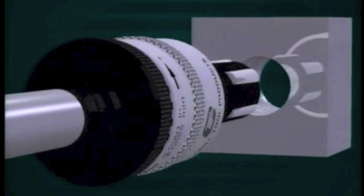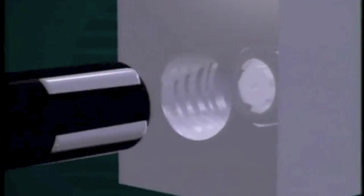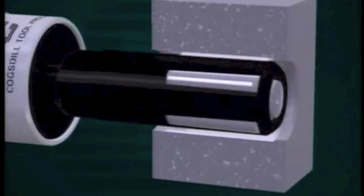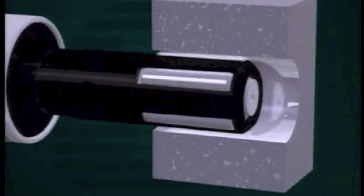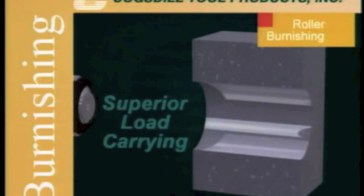This changes the position of the tapered mandrel relative to the tapered rolls and changes the effective tool diameter within the range specified for each tool. Hardened steel rolls generate pressure on the surface being burnished. As the roller finish tool is fed into the workpiece, the material in microscopic peaks or high points on the surface is forced to cold flow into the valleys or low points, creating a smooth mirror-like finish and a tough work-hardened surface with superior load carrying characteristics.